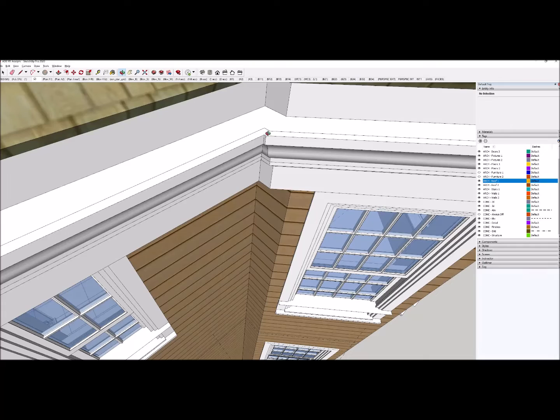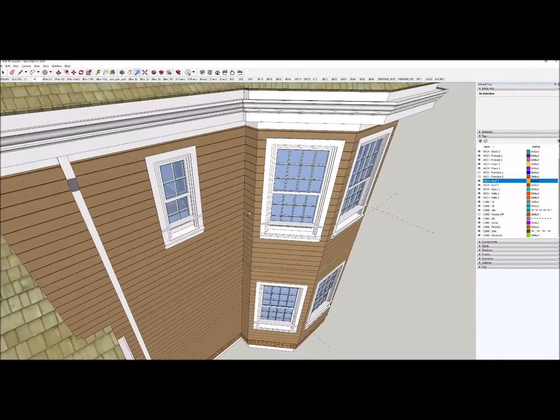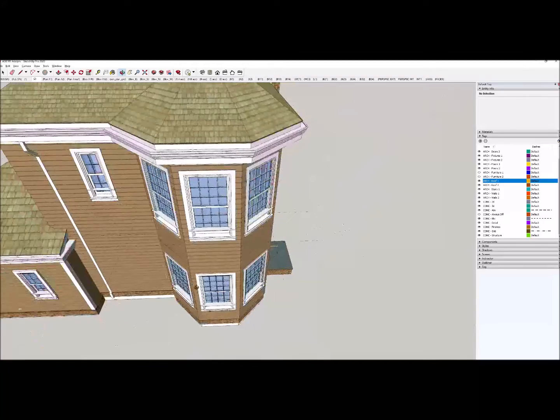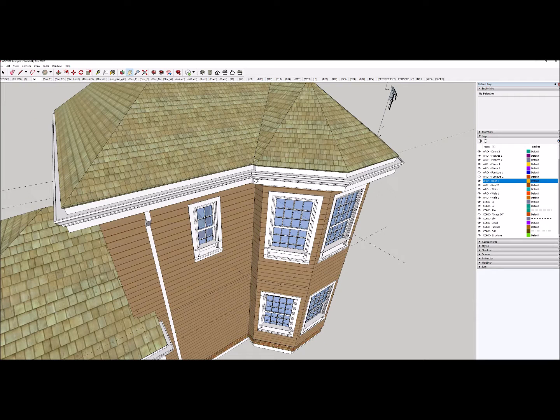So again, I think the easy way out, and the one that will add slightly to the cost but will bring value, is to bring the whole bay window out another foot. Right now it projects this distance from here out, which is 4 feet. So I'm going to increase that to 5 feet, and that means that this will come out another foot before it goes off at an angle, and that will be an easy enough length to accommodate with the sheet metal gutter. So another problem created, another problem solved. We're one step closer.